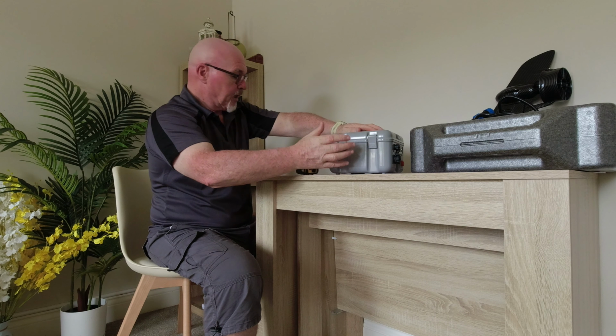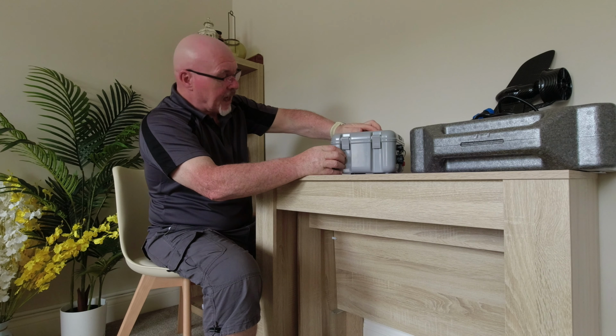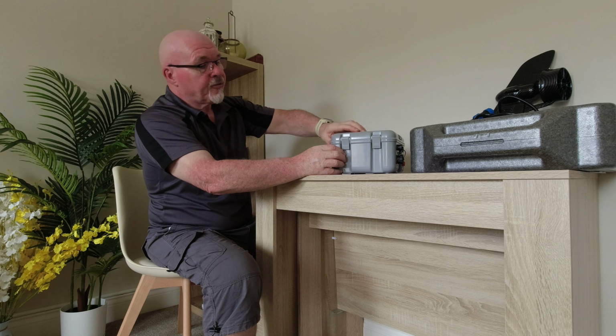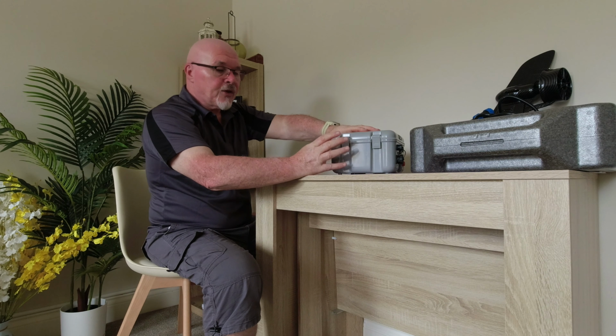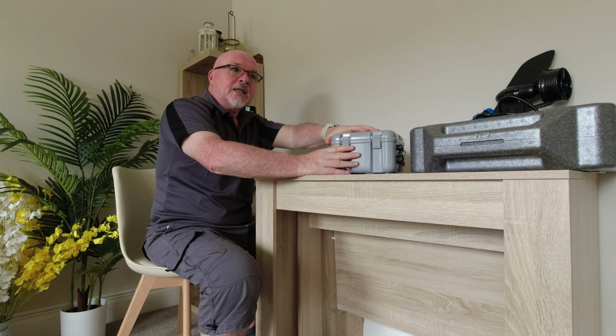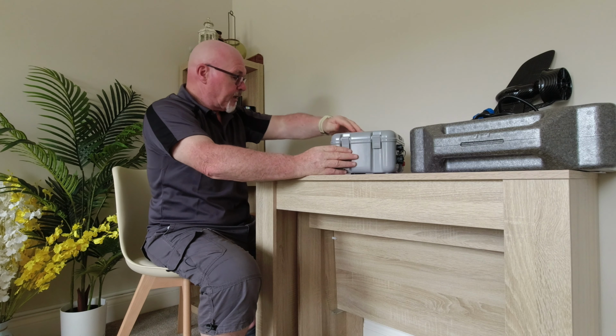So it would be two sort of car batteries. Continuous current, maximum 18 amp. The charge voltage is 29.4. Charge time from 0, they are saying, is 4 hours. I charged it yesterday and it must have been three quarters or at least more charged, because it only took half an hour to go to maximum.